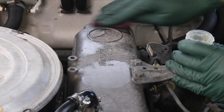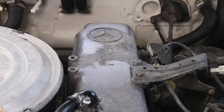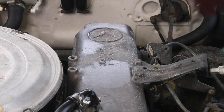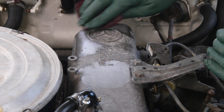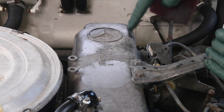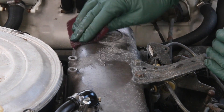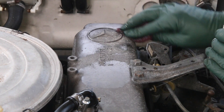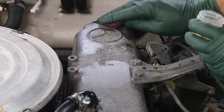Now I'm going to apply a little bit more pressure — pretty hard. That's what you'll have to do if you have an area that's heavily corroded. Then you can wipe it off and you're already starting to pick up some of that original aluminum look. If you have severe corrosion, you may not be able to do this with the anti-corrosive gel — you may have to resort to some acid. I have videos on my website about products you can use to bring back the original aluminum shine. After that, apply the anti-corrosive gel so it won't continue to corrode. Anytime you use an acid, you're opening up the pores, and that will accelerate future corrosion unless you coat it with this anti-corrosive gel.